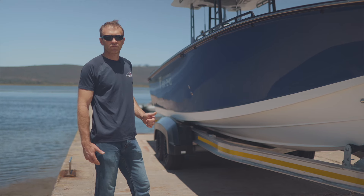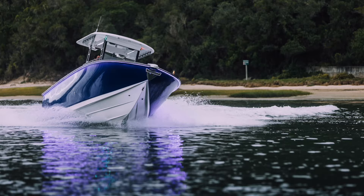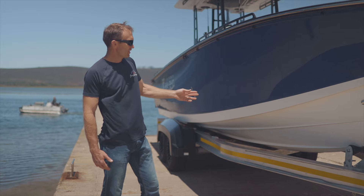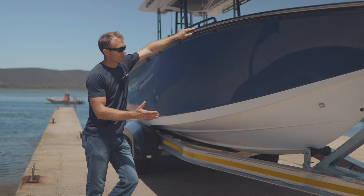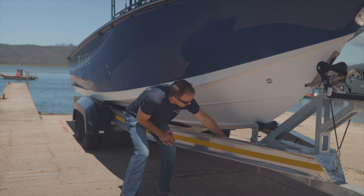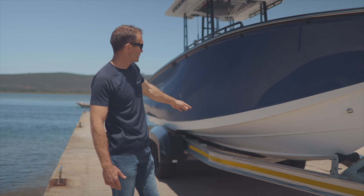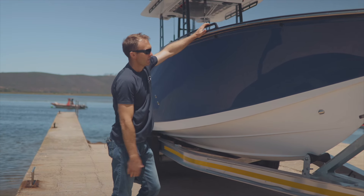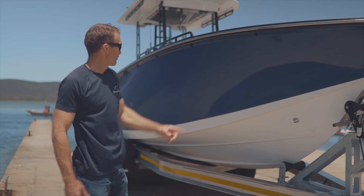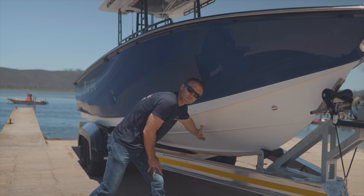When it came to the design of the boat, we wanted something fuel efficient, with good handling in the surf, and a nice soft ride. To achieve that we needed a sharp entry and we didn't want a deep forefoot. A deep forefoot is when the keel drops down deep at the front — it tends to make your boat hunt and broach when you're coming over waves. On this boat the forefoot actually lifts up, bananas up to the front, and then to keep a sharp entry we tapered the boat inwards towards the bow. Underneath, there's not much volume in the bottom — especially in the slamming zone where we've reduced volume.